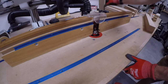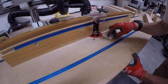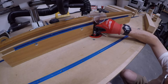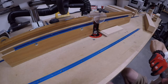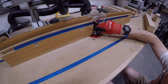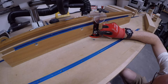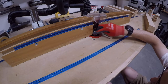Once you do this, so this is my test cut, and I'm just going to take this right on here, and with this I can set up my height. So we're going to just try to get it close. So this has two cutters. There's a top and a bottom, because you can adjust the width of the groove. So these grooves have been adjusted to fit my particular quarter inch plywood when I use it. So right now we're using different materials, so it doesn't matter the thickness.